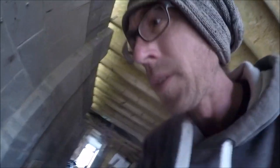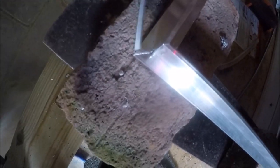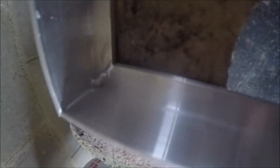So you just find, if you just keep on rubbing the rod just over it like this, all of a sudden it will just take, and you can see this tiny little line in here, and it's actually turned out pretty neat. Well, this one hasn't, but look at this inside one. Get that. That is lovely. So fingers crossed. I think also don't be shy on your V-ing out. I think like the deeper the V, the better the hold.